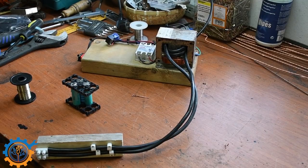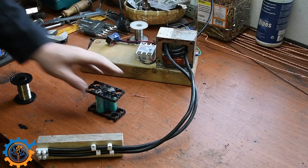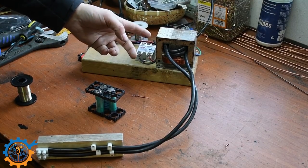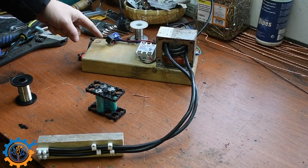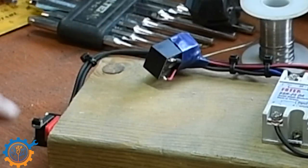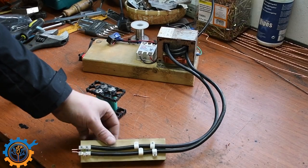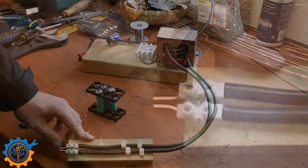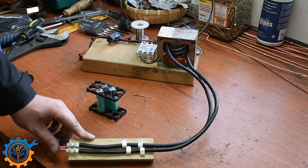The welder is finished. In all its glory, this is a simple spot welder built out of this microwave oven transformer, SSR relay, 5 volt DC buck converter, and this microswitch here. The handle is simply made of wood, and I have these 2.5 mm copper rods here — they can be switched out rather easily because they will wear out.